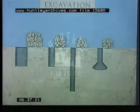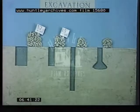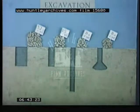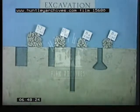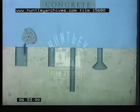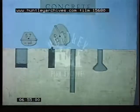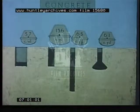First, the quantities. Excavation for the narrow strip foundation is therefore less than half of that for the deep traditional strip, and that for the two pile foundations is only about a quarter of this. The 13.6 cubic yards of concrete in the narrow strip foundation is more than double that required for either of the pile foundations.